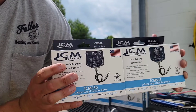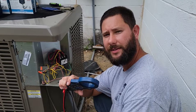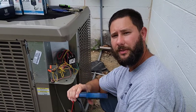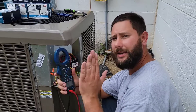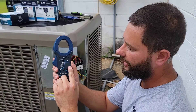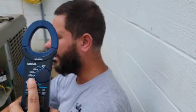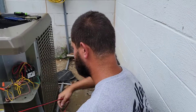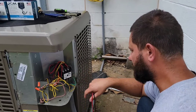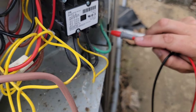How do you know which one to use? To figure out exactly which ICM Controls product you need to protect your three-phase air conditioning system or three-phase equipment like a motor, you're going to need a meter to do a simple test. Turn your meter to volts AC. We're going to measure from ground to each phase. We've got three phases because this is a three-phase air conditioning system. We've got a three-pole contactor with three legs of power — one, two, three — and a ground wire.